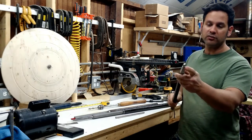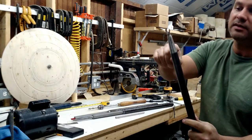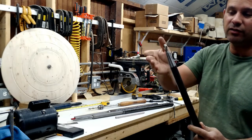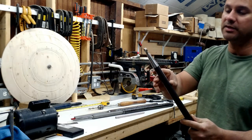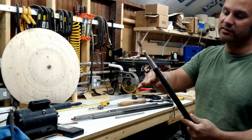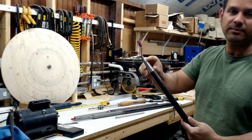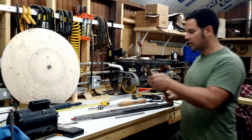I drilled the hole for the termite tool and a cross hole that I drilled and tapped for a set screw. You'll notice that I tapered the end, and this was so I wouldn't have a large diameter very close to the tool — I would have clearance so the large diameter wouldn't hit any of the work that I'm doing, keeping it free from striking the work piece. What I would do differently is make this taper a little bit shorter, because right now I have to have the tool rest all the way back. If I had to make another one, I'd just make this taper a little bit shorter — it didn't need to be this long. But it works great, and if you have some skills, I would recommend you make one.